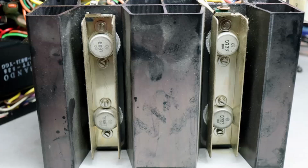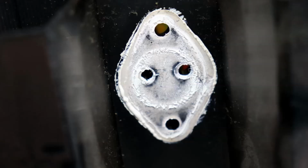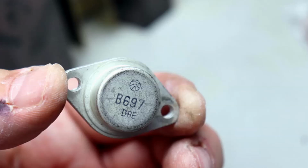Power amplifier taken apart, assembly, and output transistors. I'll replace some of the mica transistor insulators and clean up the old thermal compound, something that's needed since it left Japan 40 years ago. These are the original power transistors, so this will help them stay cool and hopefully last another 40 years.